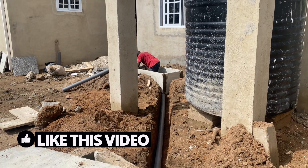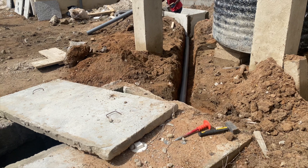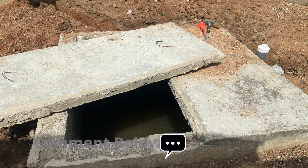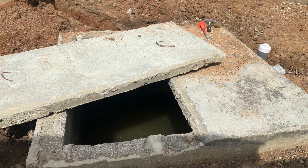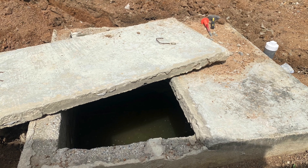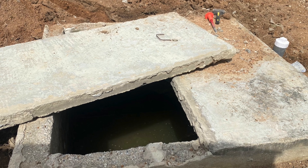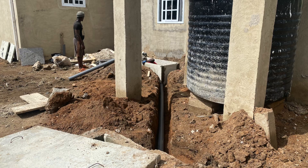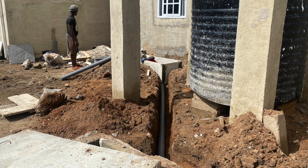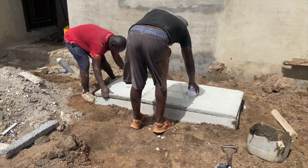In the worst case scenario, leave a clean out at the top. If it's not working, have a pump take the water out from the soak away; otherwise the soak away will work well for a biodigester because you always have access to the water in the digester. That's exactly what we did right here in this digester. The next time you are constructing a biodigester, ensure that you have a better option for the wastewater management. We seal the biodigester held tight.